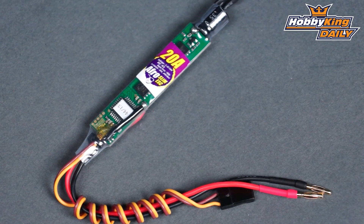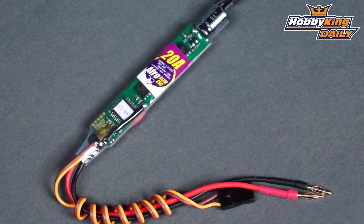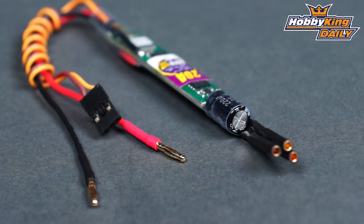The only thing that's derating it at 20 amps is that we've got 20 AWG wires on it, which drops the amperage on it. It's also designed to go in smaller, tighter areas, so the cooling might not be as good — so we underrated the FETs as well.